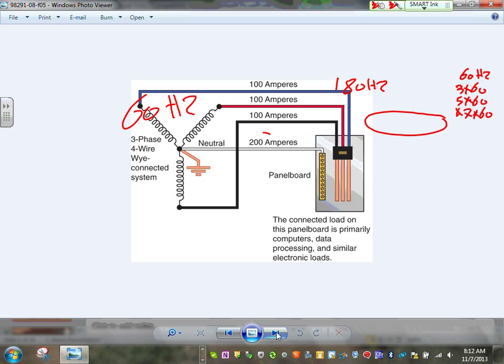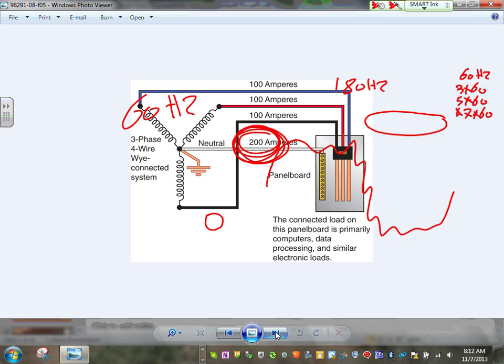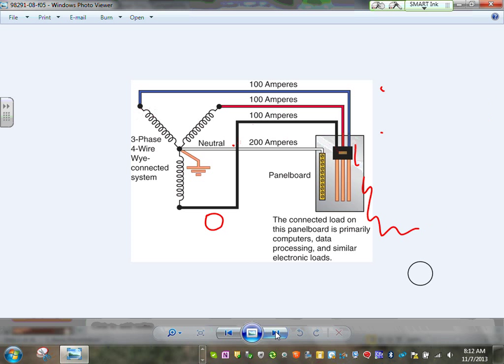Okay, but for the time being, because of all of this, Adam and Derek, my friend, what you end up doing is doubling the neutral size of the data center because they're ugly. Can you guys see that? I'm pulling the yellow one. And instead, look how nice this is compared to that yellow one, which will damage your equipment. In order to live with the evil, which is harmonics, you basically oversize things a little bit. There's also another way of living with the evil: eliminating the evil. How do you eliminate an evil? By having harmonic filters, and this is not the topic for today. What they can do, guys, is they have harmonic filters that grab these signals, choke them, and eliminate them from affecting other equipment in your building. So harmonics is a major, major thing that we will continue to talk about when we go to the commercial.